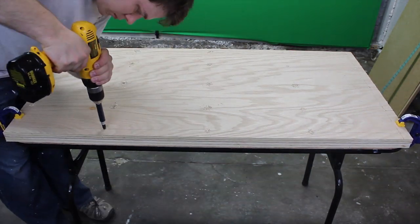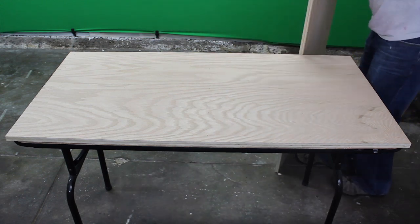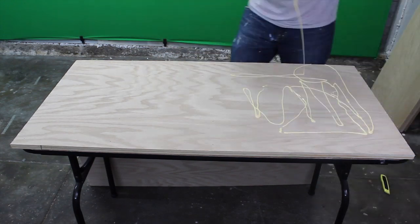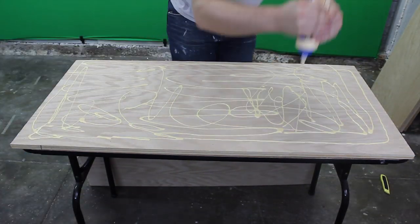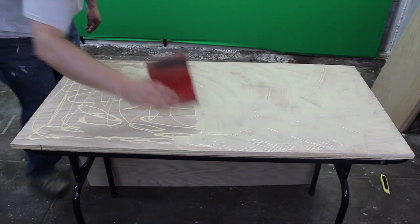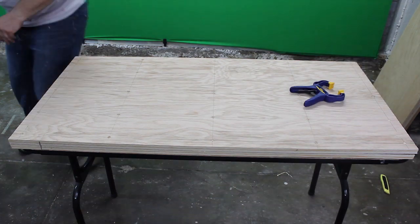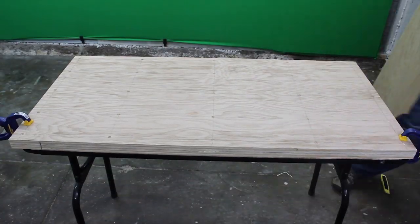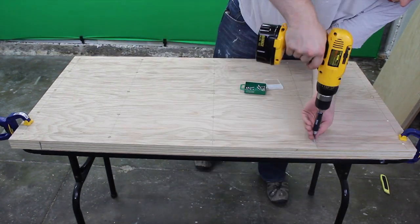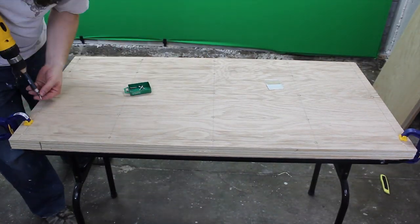This is only two pieces of plywood — we glue it together and screw it. Now that your grid is laid out, take off the top piece because we have to laminate the things together with glue. Make sure all the dust is off. Just dump tons of glue — I used probably about 16 ounces on each side, so you're going to go through a ton. Use an old piece of cardboard to wipe it around in a nice even coat all the way so there's no wood showing, just glue. Now line up that one corner we talked about — how critical it was to make sure it was square. Put in your screws and start from the middle working your way outwards, so you squeeze all the glue toward the outside and you'll have a very even, nice clamp.